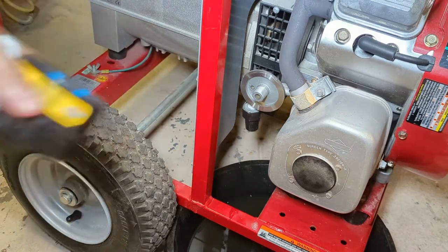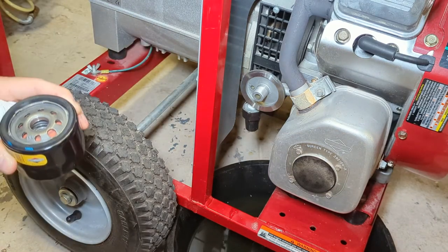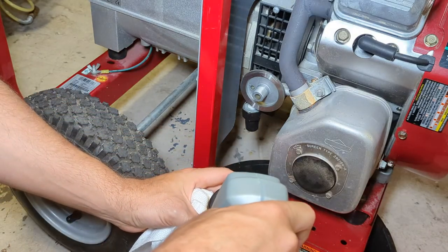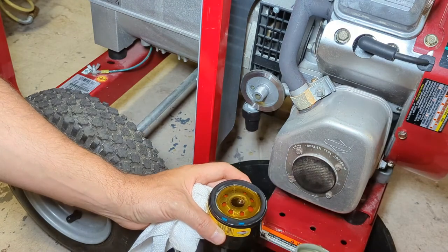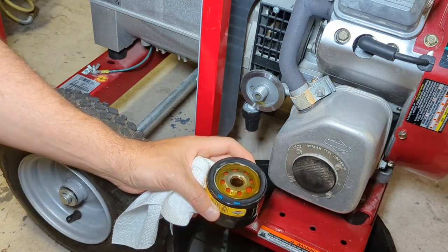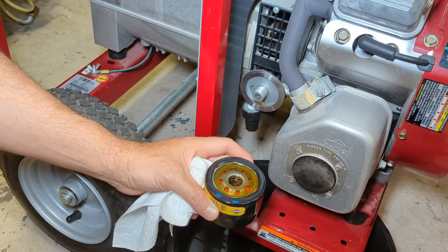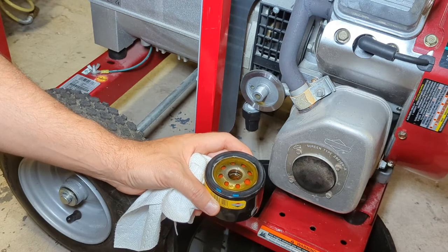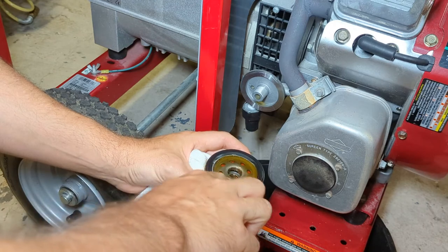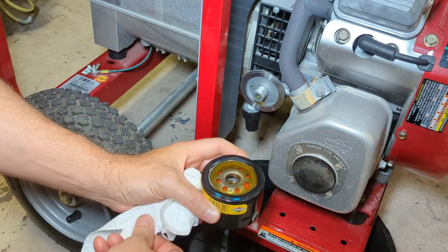Okay, I got my new filter. Pre-fill it with some 15W-50 Mobil 1, while the pan's still here, because this is undoubtedly going to make a mess. This seems to be the oil of choice for outdoor power equipment in Florida anyway. It has a bit more zinc than your average engine oil, and I believe even a lot of the other Mobil 1 oils. Don't know exactly why that is. It may have something to do with its multi-application formula.